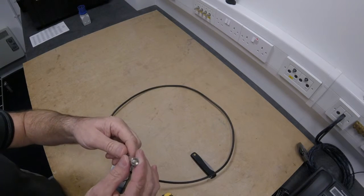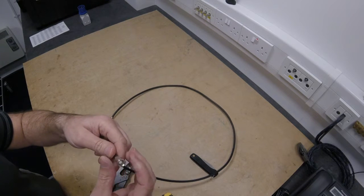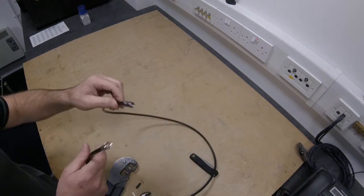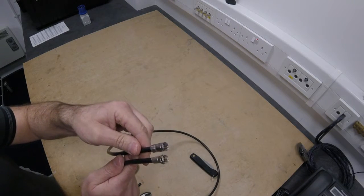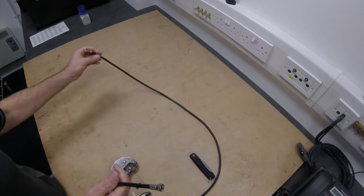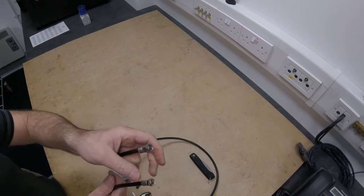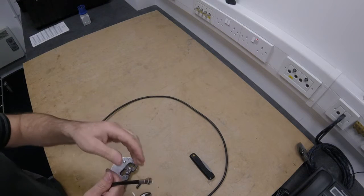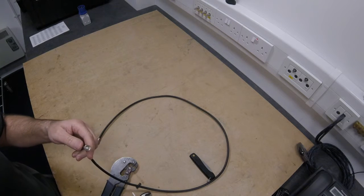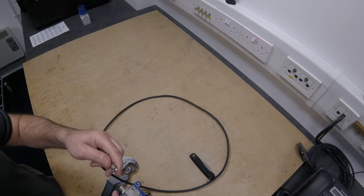There's your connector - it's a good quality F screw-on connector this, not ideal, I still prefer to use the CableCon crimp connector shown previously. The CableCon will give you a far better connector at double the price of one of these screw style F connectors, but it can still be used, especially in the domestic industry where it's very common.